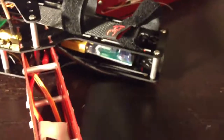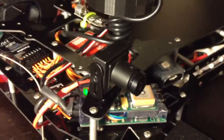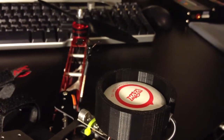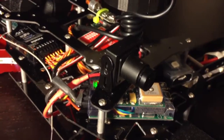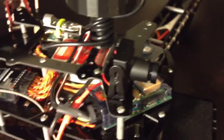The board that reads your battery power is here in the back of the unit, and it reads basically how much voltage you have left on your battery. As far as the camera is concerned, I got this from Future Hobbies. It's a CCD camera and I think the guts are from Sony. The actual model number is the FHC55-5V — that 5V is for 5 volts, so it's a 5-volt camera. It has 550 lines of resolution, so it's a nice camera. It's not HD or anything like that, but on my goggles it looks pretty crisp.